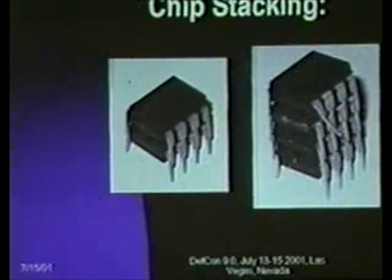Why do you have the one pin pulled out? I have the one pin. That's one of the address lines, and basically I just wanted to provide an example of how, if you don't want that pin connected, normally you would tag the pins together with solder, but if you want a pin to go somewhere else, it's really easy to just lift it up and run a wire off it.